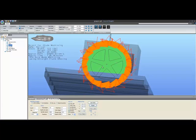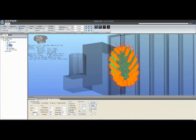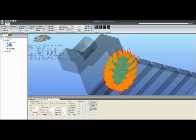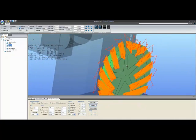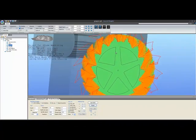These tool paths, now that we're actually displaying them so that you can see them, actually provide quite a bit of information. In Mach 3, I was always very careful to keep the machine coordinate display away from all influences of the system so that it only counted actual pulses going to a stepper motor. I did that to ensure that I was always safety checked when I did further programming. Here I've done almost the same thing. The code which displays the fourth axis toolpaths has nothing to do with the code that generates the toolpath. So if a toolpath looks right, it probably is. If it looks wrong, it probably is. So it's certainly worth checking.